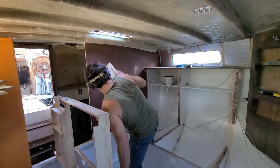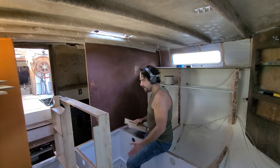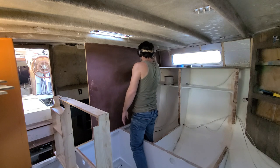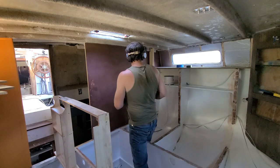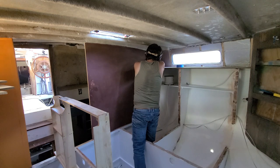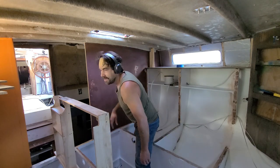So you might be wondering why I choose to build the boxes and then hack them up to fit into the parameters of the boat. And you know, I've done it both ways, and I find this to be the easiest to be accurate with. Getting the angles right is really difficult, but when you start with something that's square and then cut the corners off, it's a lot easier to get the angles right than if you try to build it right in place to suit, especially with the face pieces. So that is why I go this route. It might not be the most efficient, but hey, if you find something that works, that is level. So I'm gonna call this a victory. See you in the morning.